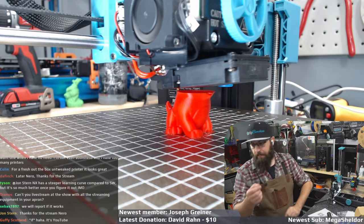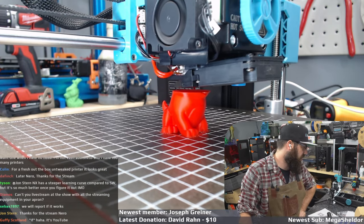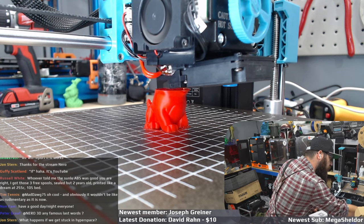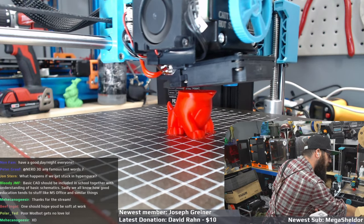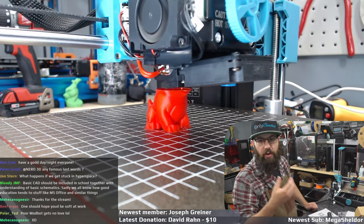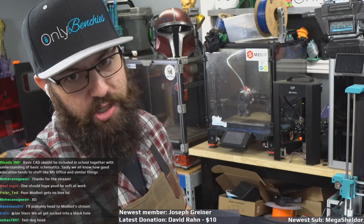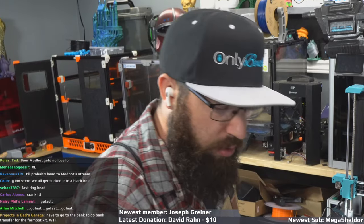It looks like it should be working. Oh no, I'm not kicking you out. We still got a while on the dog. We're at like 57% on the dog. Let's speed it up so the head of the dog will be faster. Tune, speed, let's go to 150. The thing is, we always try to speed these up, but usually you're limited by the firmware acceleration limits. You can speed it up, but you're already capped out at like 1,000 millimeters a second, so it can't go any faster.